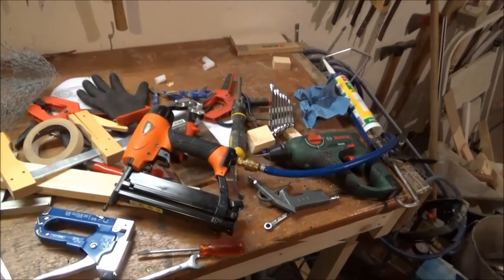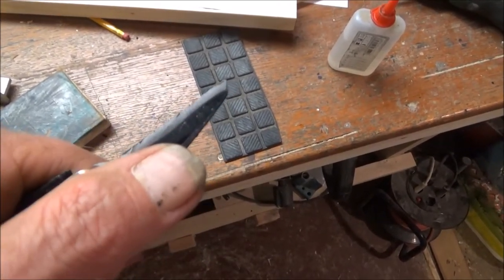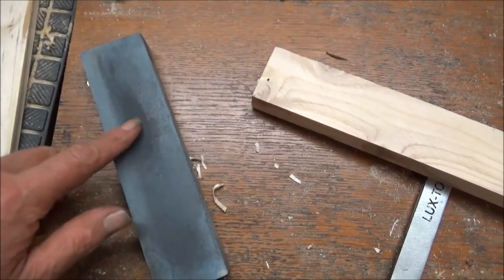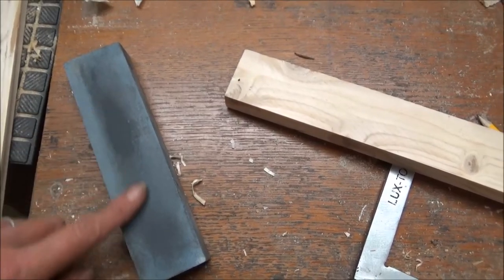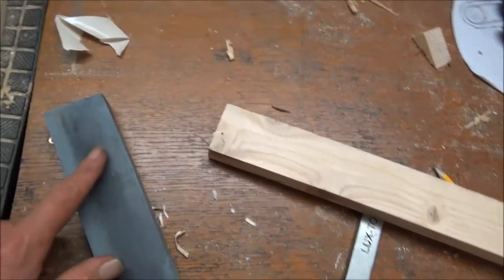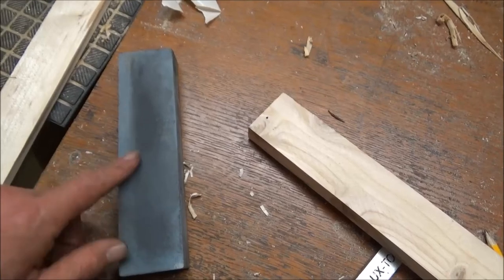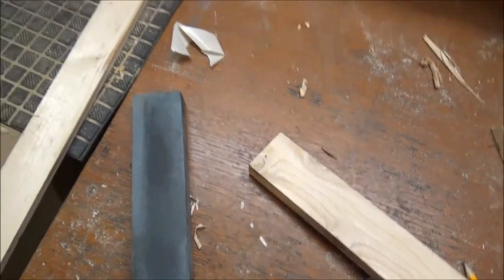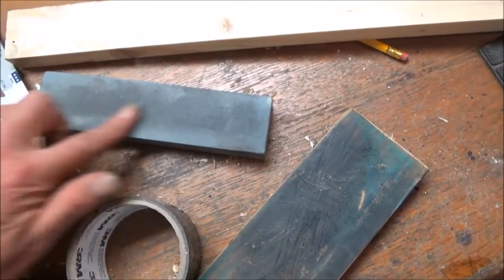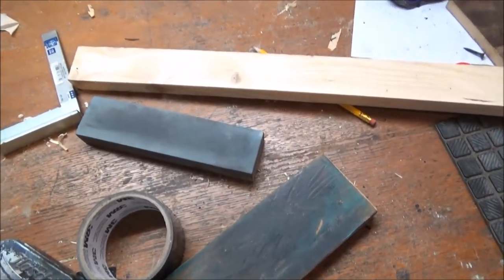I'll just show you this - see that? It's not straight where I've been grinding it on the stone. That's a dipping stone, so I'm just putting it on the belt grinder to flatten it. Needs to be flat - something to watch out for when you're doing gouges is you'll wear the stone in one place. Keep your stones flat. That's better - there's no discernible dip now. That's where it was gouged out - flattening it will make it a lot easier.